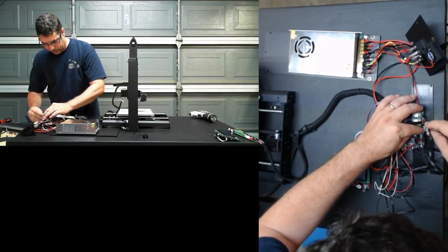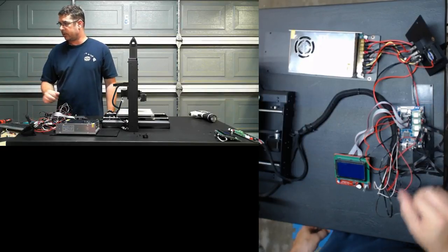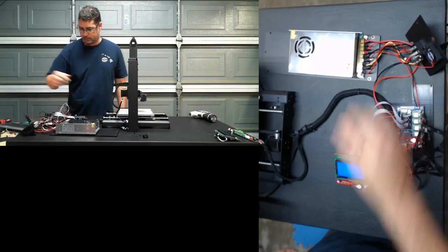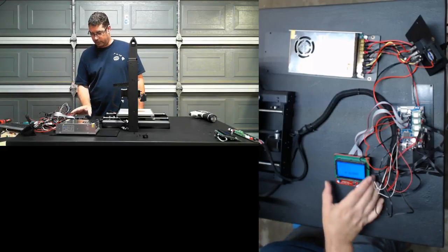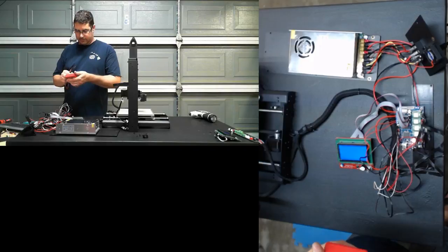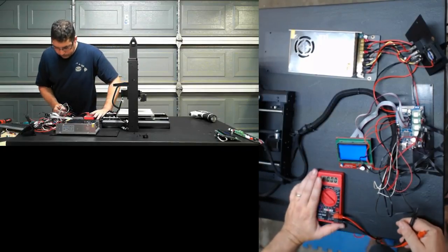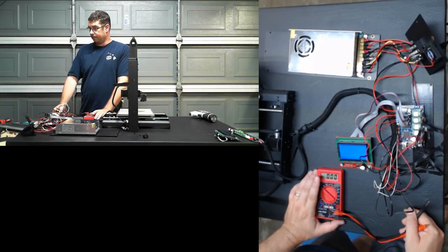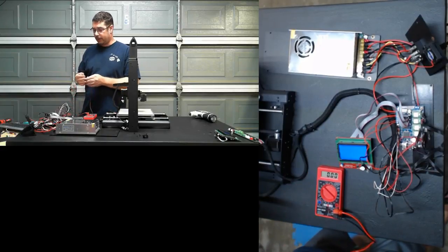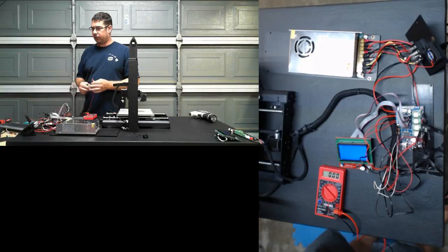I'm going to hazard a guess here, the reason we're getting that grinding and the slower motion is that the stepper drivers are not at the appropriate voltage, or current, I should say. So let's get that. Reverse the reversal. Yep, exactly, Paul. Reverse the reversal. Okay, so we break out our handy dandy voltmeter here. All right. So Ray, question for you again, just to verify if it's different with these 4988s on your board versus the Ramps or another board. What is the preferred V reference voltage for the 4988s on the mini here?